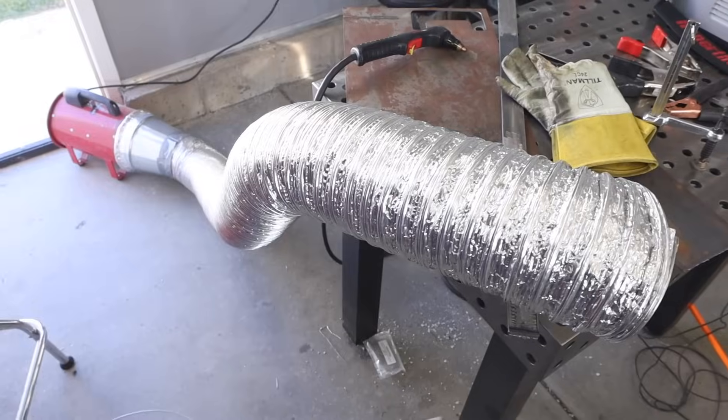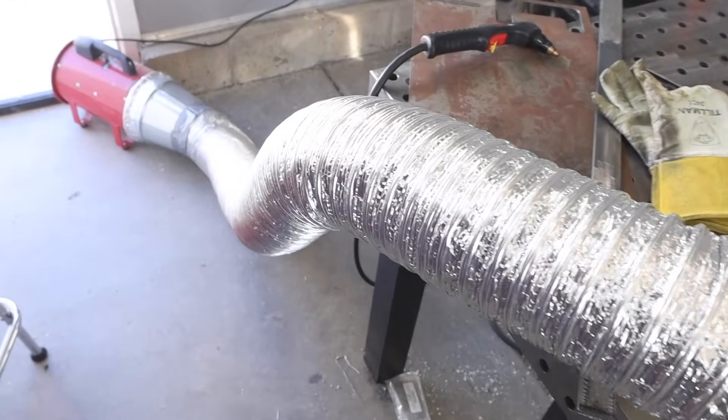Material can get really hot — sometimes if you cut fast you can touch things right away, but be very careful not to touch your material or get in the way of that plasma arc because it's very hot and could definitely burn you. This is also a really smoky process — all that material from your kerf goes right into the air. I'm using a makeshift fume extractor and have both sides of my garage open for a cross breeze. Wearing a respirator is not a bad idea.